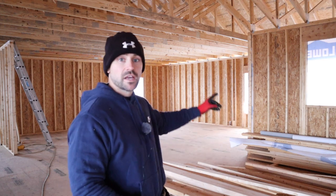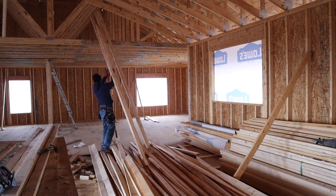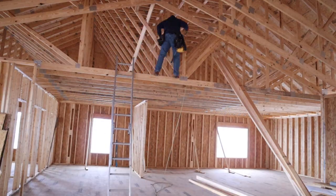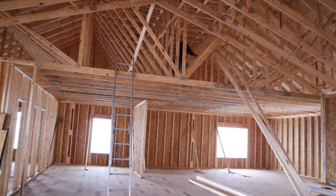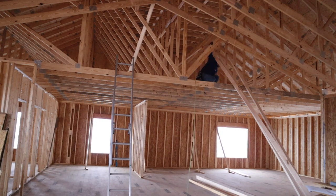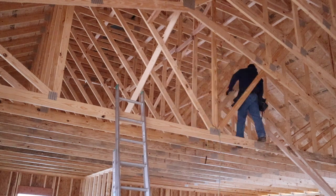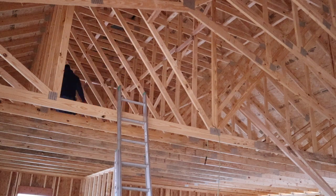What I'm going to do is take some of these 16-footers, lay them up here against this open truss up above me, then pull them up and get them nailed on for bracing. When you work by yourself a lot, you learn you got to do stuff like this quite often — but it eliminates a second man. I was kind of glad it was snowy this morning because it gave me a reason to work inside. I've been meaning to do this bracing for a while. If you look below me, that's a bunch of space that needs walls yet. After I get this bracing done, that's what I'm going to be doing next — probably the next few videos. I actually got to order more 16-footers because the ones I got ended up sitting around too long and got all twisted and bowed.